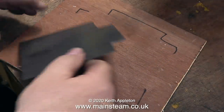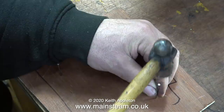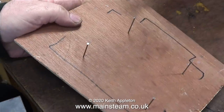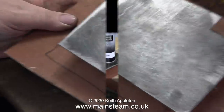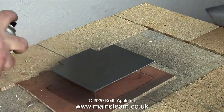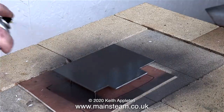Here's a top tip: I want to paint both sides at the same time and I'm doing it like this. I only drew around the part just for effect to show me where to hammer in the pins. I'm being very careful not to nail the piece of wood to the bench - that's why I keep looking underneath it. The piece of metal sits on the pins; I paint one side then I turn it over. There will be four slight marks on one side of the paint but that's going to be the underneath so it's not going to be a problem. I'll paint the underneath first, using Auto Paint Northern etching primer that I normally use. After shaking it for several minutes I give the part a good coating - it's better really when using etching primer to spray it on thinly. That's the underside painted, and now I'm turning it over, sitting it on the pins, ready to paint the top surface.